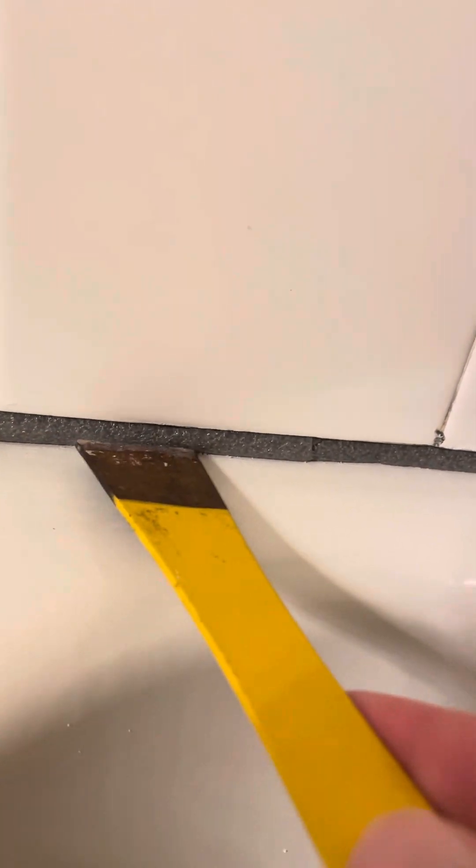I'm going to go cut another one. An important point: before I put the backer rod in, where the wall meets the top I put a layer of caulk in that corner, just in case water gets behind this and passes the top caulking. I don't want that back area to be exposed, so water doesn't go behind the top and create nastiness — especially here in Florida. So behind this I did some caulking.